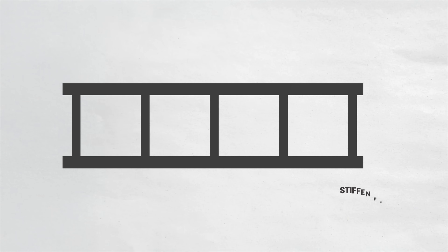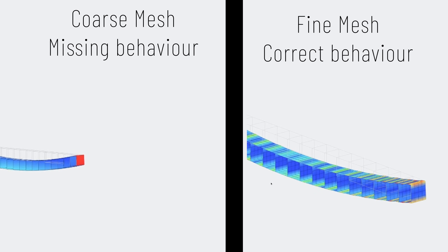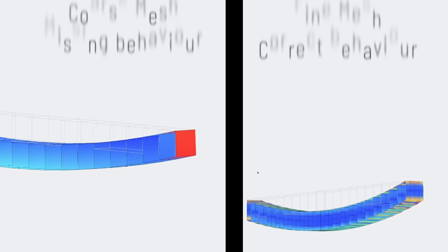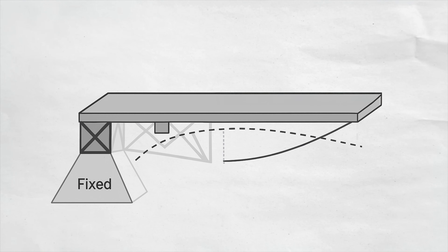Let's break down this simple aspect and how the loads transfer through this simple structure. We have two plates and some stiffening joints at given centers. So we've got ways that we need to transfer moment and shear. When you look at the FEA, the moment forces aren't too bad and they sort of align with the hand calculation — you get the push-pull nature of the system. But we're looking at the vertical load — where is it going? Let's think about a plate with a stiffening point, like a Vierendeel truss, moving down.